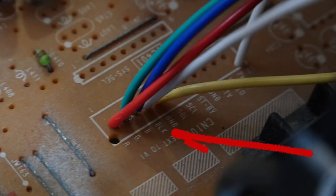Adding that matching 470 ohm resistor will halve the voltage down to 2.5 volts using the voltage divider method. I never knew that was in there before — this is one of the things I've learnt as I go. But you can utilise the resistor that's already in circuit rather than trying to manually create your own voltage divider, which can be a little bit messy and a pain in the backside. So that's the blanking side taken care of — 5 volt regulator, matched resistor added, voltage halved to 2.5 volts feeding back into the blanking spot on the header.